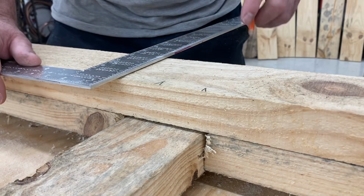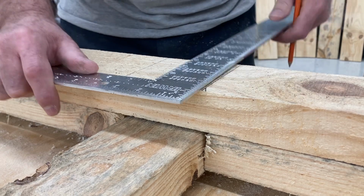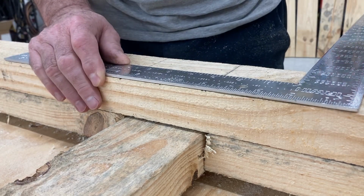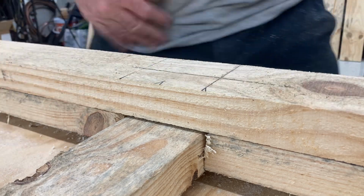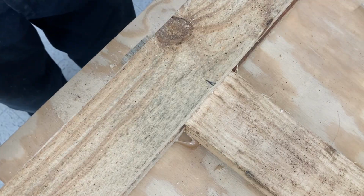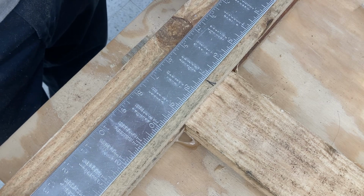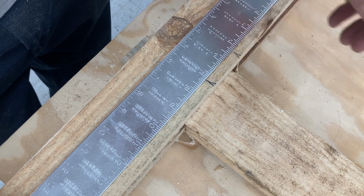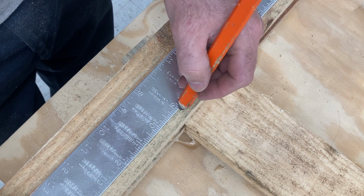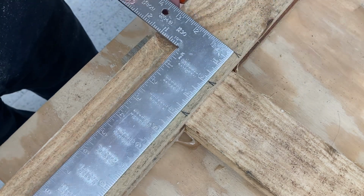So there's 2 intermediate supports in these doors to support the sheet metal. And I'm not going to run the rabbets all the way across the vertical 2x4s on these, because I'm afraid that would weaken the 2x4 too much. That would get it down to where it wasn't really anything but a 1x4 where the joint is. So I'm just running the intermediate supports 1.5 inches across the vertical supports.